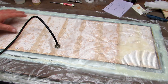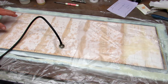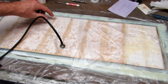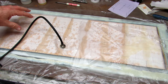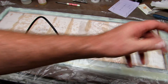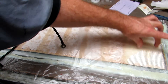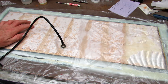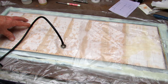What I've got here is a mirror sitting on top of the workbench, and on top of that is a piece of peel ply. Then I've got three-inch wide sixteenth-inch balsa running lengthwise, and on top of that is 0.2 ounce carbon veil, all wetted out. Then I've got three-inch strips of sixteenth-inch balsa running the other way to make a balsa-carbon-balsa plywood. On top of that is another piece of peel ply.